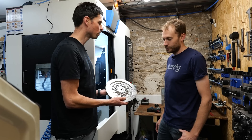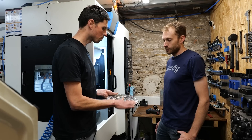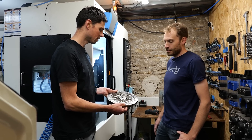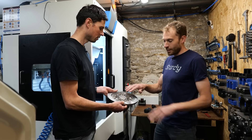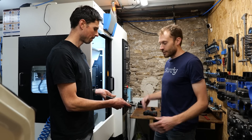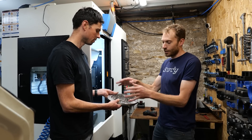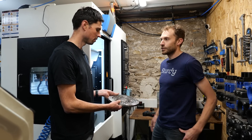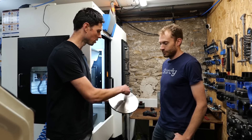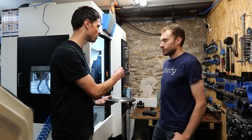It's just going to dish out the rest. I can already feel it's way lighter than it used to be because all that material is gone. This is the best part of two or so hours' work — removing quite a lot of material will actually completely distort the plate as well. That's another thing you have to learn to account for with machining — all of that material gone, that whole plate would have bowed and be a different shape now. So now we need to flip this over, locate it using the cutouts for the dowels, and start the correct program.